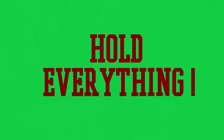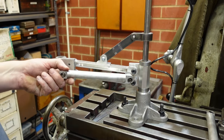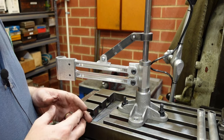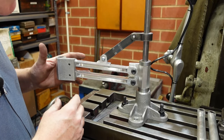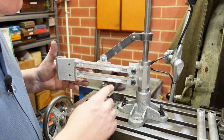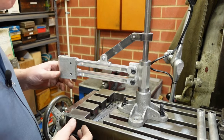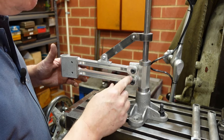That's about all I've got time for today - I'm running out of daylight. Last time you saw this it had round bars on it, just plug welded around and smoothed off. But two things happened: a friend came in and said can't you do anything better than that, and also the piece that goes on here ended up having an I-beam type section. Having round bars with an I-beam section seemed silly, so I've replaced them with these - machined from solid, same bushes and all.